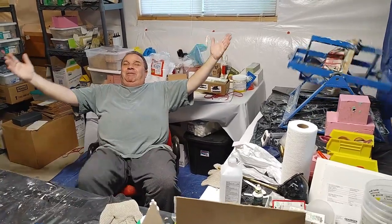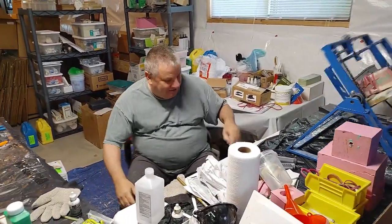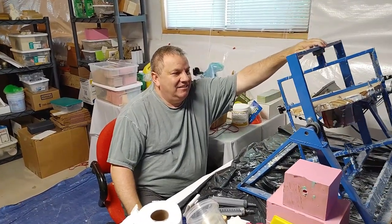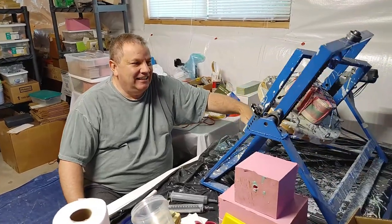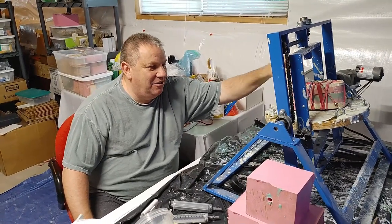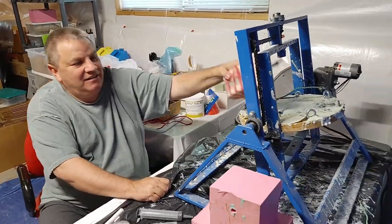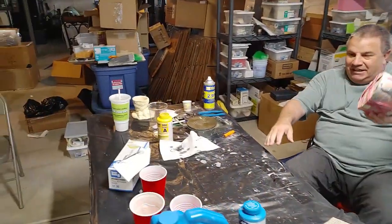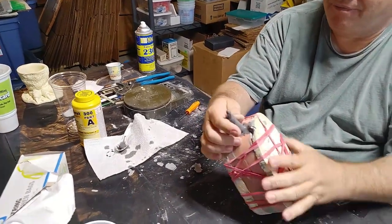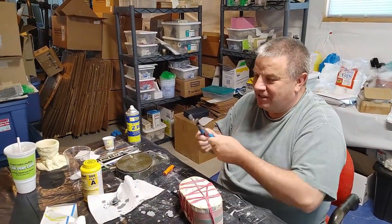Our timer's going off — we cut the power. You always have a little leakage, especially as worn as these molds are, but that's normal. The key is you don't want resin flying all over. Now we're taking all the bungees off and coming back over to the work area. There's some leakage but it's within acceptable range.